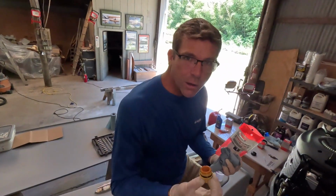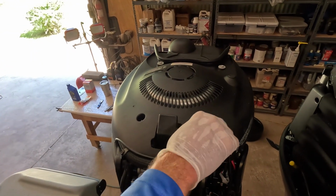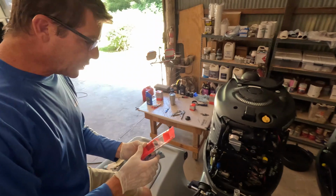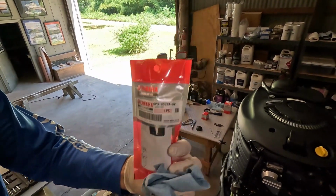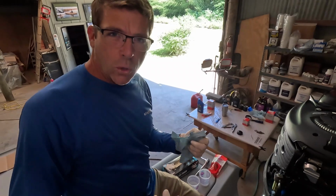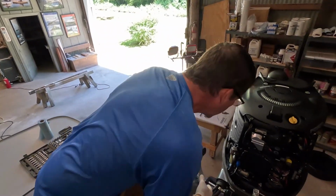All right, folks, so we got our 4.5, 4.6 quarts of oil in both motors. Now again, I don't like to risk overfilling them. Finger tight on that little oil drain plug, and we are moving right on to the Yamaha fuel filter. Now, many of these kits, you can go online and actually get a service kit where you've got all your oil and filter and everything there. You just want to be sure you've got exactly the right part.